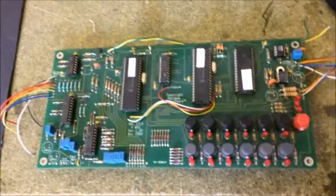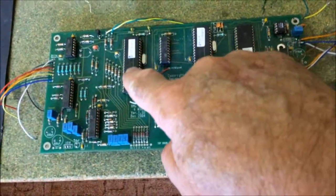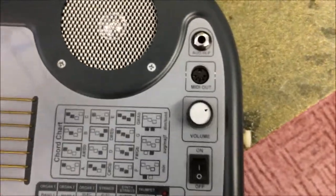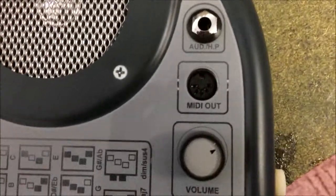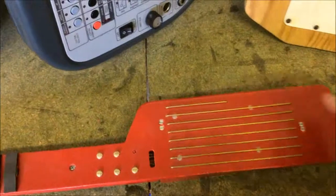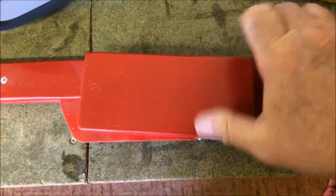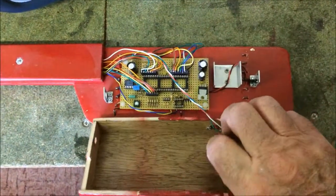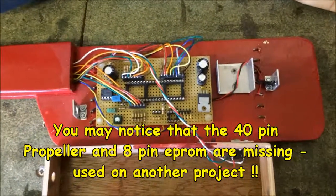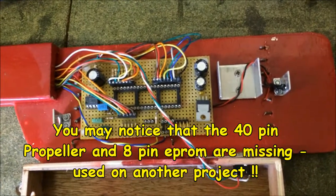This is the board from the Easy Chord, and it uses two 18F452 PICs — one is a controller and the other is a sound generator. It has MIDI out, so it can drive an external sound module or music keyboard as well. The circuit was getting quite complex, and I later condensed it all down to a single propeller chip, which is basically an 8-core 32-bit processor in one 40-pin package. The propeller could do the touch sensor strings, controls, MIDI out, and also generate some very nice instrument sounds all by itself.